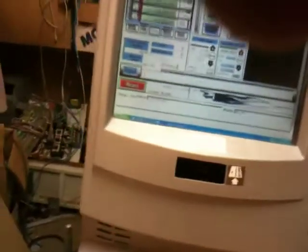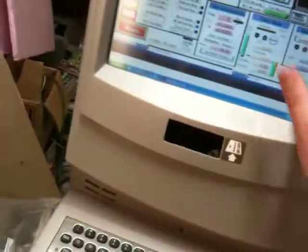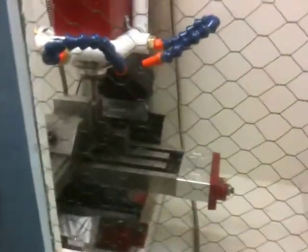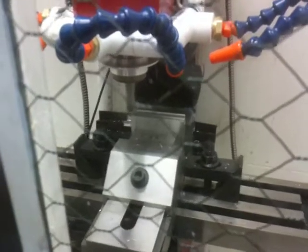I'm just going to manually jog this. We're going to go down 25 thousandths, so we'll take 25 thousandths off in one pass and line it up so we can take a full cut. Crank it right up — 5100. Fire that thing up. The treadmill controller is a little slow, takes a few seconds to spin up. And there's those terrible bearings — those are getting replaced next week. We're going to go with 25 inches a minute through that block, 25 thousandths deep. There it is — full half-inch cut, 25 thousandths deep. It doesn't seem to mind too much.